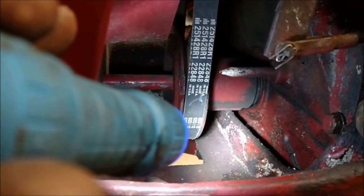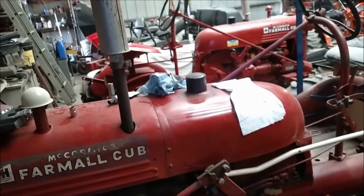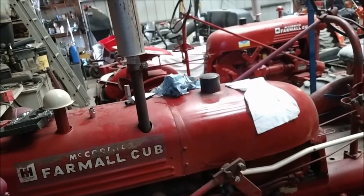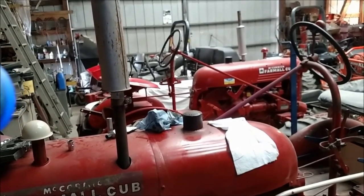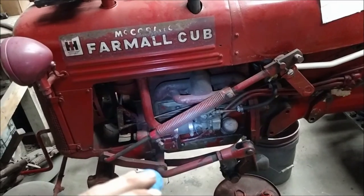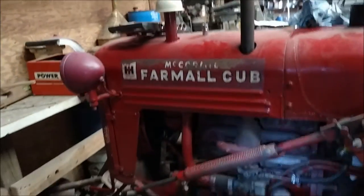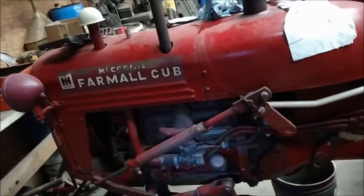You can definitely tell this is a white demonstrator cub — you can see the white paint underneath there. On that cub, I've got a Zenith carburetor and manifold that will give it probably right upwards of 14-15 horsepower. I'm going to take that carburetor off the 51 cub and put it on this cub here. This carburetor had a stripped bolt that I fixed with a special shaved nut. Other than that, I've got a little rear main oil seal leak, but this cub is good to go.